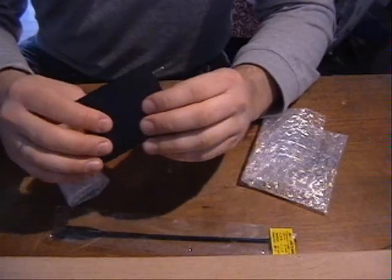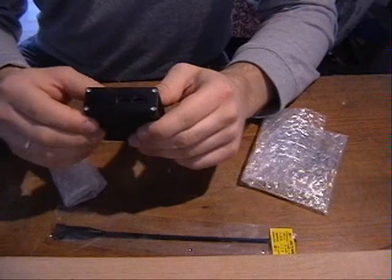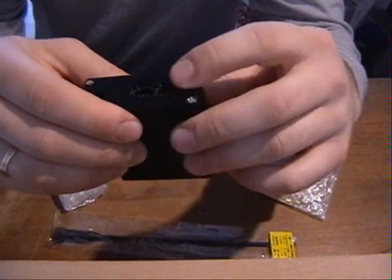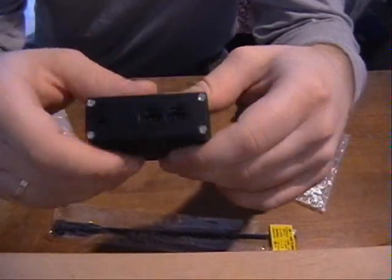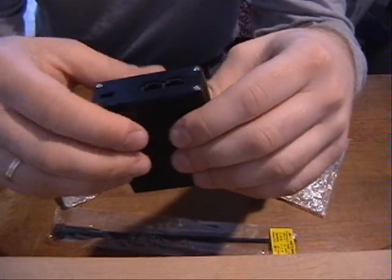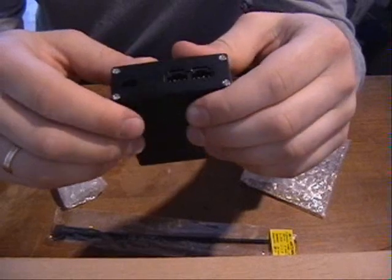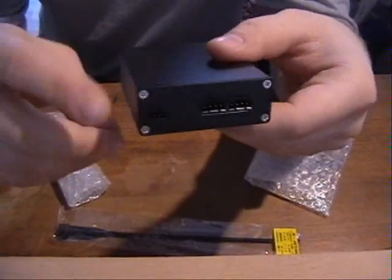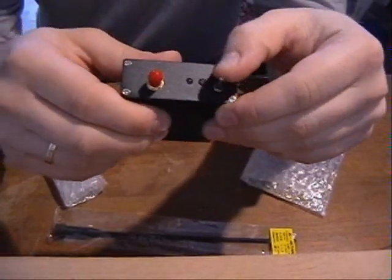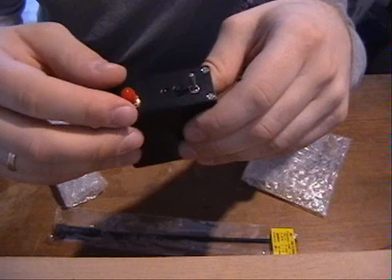It's made with an aluminum cover — an aluminum suitcase. On the bottom we can see two custom sockets. One is to be connected to the head tracker and the second one is to be connected to the battery and the PPM signal from the transmitter. Here we can see an additional socket, probably for configuring the whole module and to communicate with your personal computer. On the top we have a power switch, the binding button, and of course the SMA socket for the antenna.